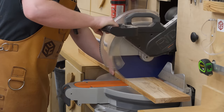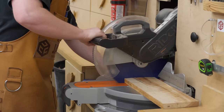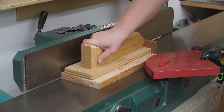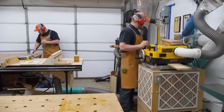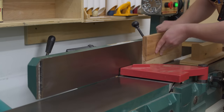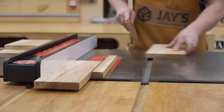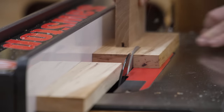The milling process is quite quick. I start at the miter saw to cross cut to rough length, then go to the jointer to flatten one wide face. The planer makes the opposite face flat and parallel. Back to the jointer to get one narrow face square and flat. Then at the table saw, all pieces are ripped to final width and cross cut to final length.